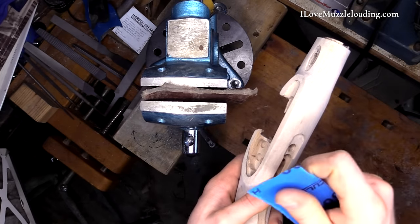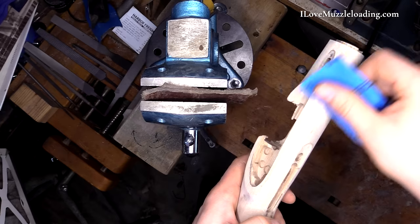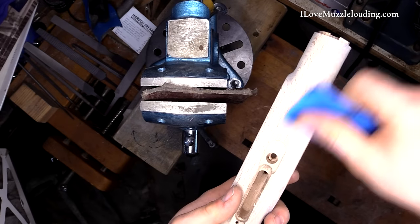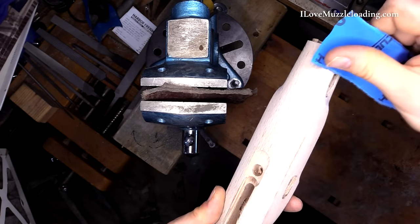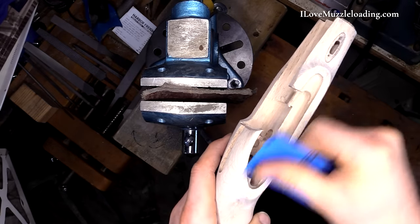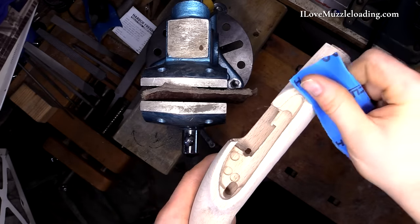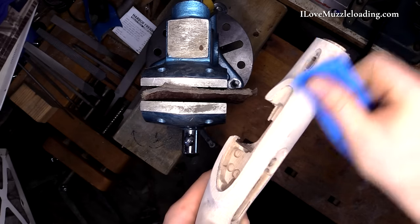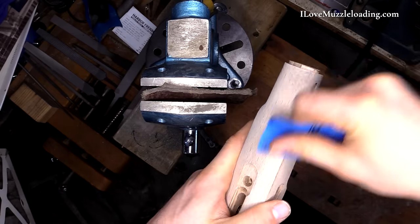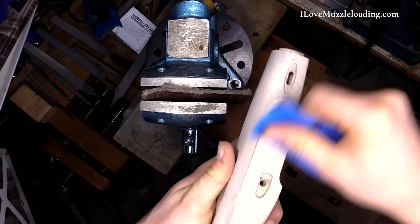This is how I do it — you might do it differently. I'm just backing this one by thumb. We're doing a gentle pass, just enough to remove those curls and grain. I'm not pressing hard at all. Sometimes, depending on the grain and the wood that you're using — based on my understanding it's how hard or brittle the wood is — but if you have like a hard walnut stock or a tough maple stock, you can just rub your hand over those curled up pieces of grain and it'll peel them right off.